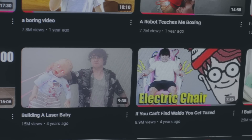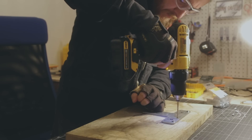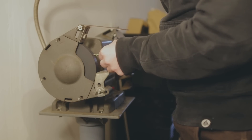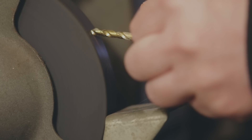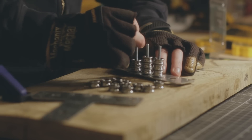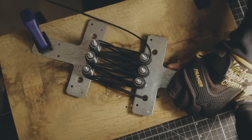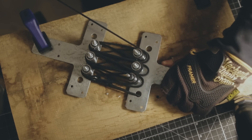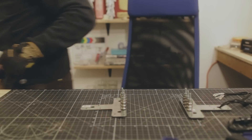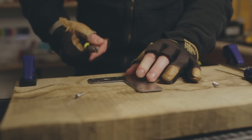To be clear, Michael Reeves didn't die — he just posts later and later with each video, so he's just late. Anyways, metal is weak. While drilling the holes in these two plates, I broke three screws and somehow managed to snap the end off one of my drill bits. I didn't have an extra one, so I did my best to resharpen it. I probably should have Googled how to do this correctly, but whatever I did seemed to work. After I carefully finished drilling the rest of the holes, I attached the bolts and pulleys and realized I'd messed up.